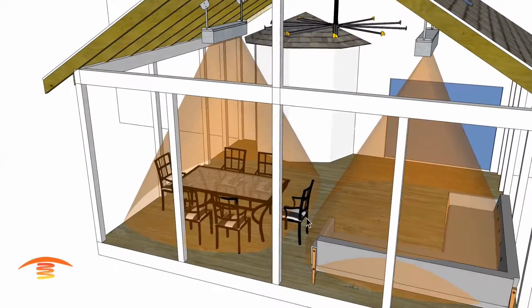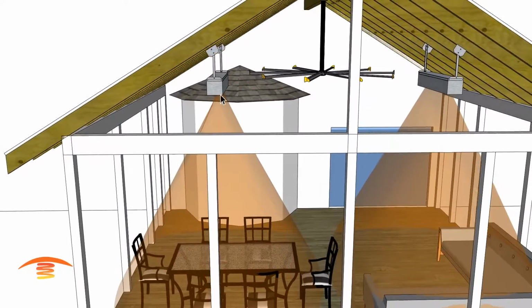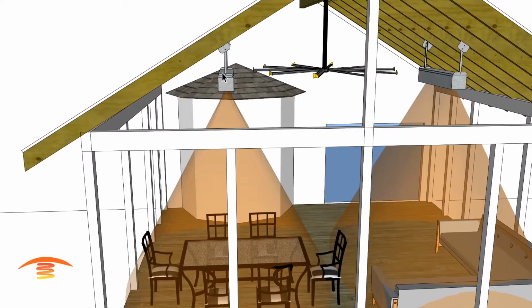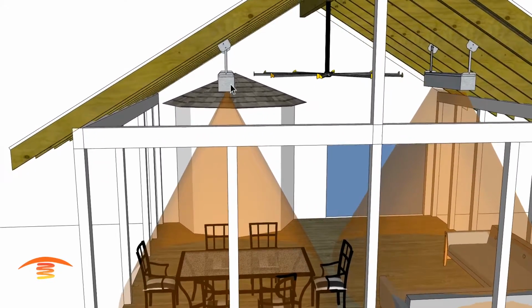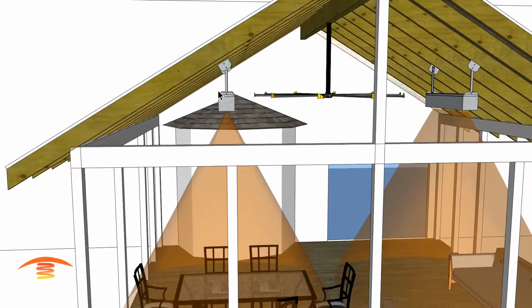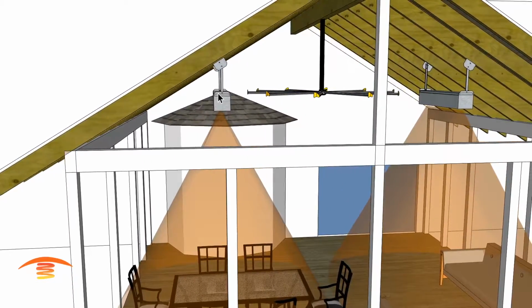We are missing the center slightly, and that's only because I would like to put it at a little angle and bring the heater down a little bit. However, once I angle this heater, then it increases the clearance to, I believe it's 17 inches of clearance. So I don't want to do that if I can avoid that.